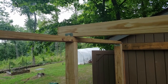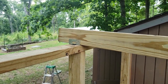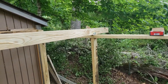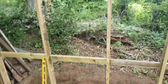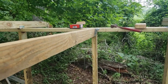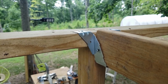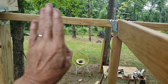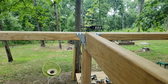So this was our first plan — we just put one up. We had these up like this with a little 3.5-inch overhang and were going to put tin on that, with about a 12-inch overhang in the back. But we decided to change it — we're just going to leave the top open and put a tarp over it. What we did is we went to the inside with those little joist hangers, and the hardware cloth will just go right over the top. We'll run bracing and purlins all the way down on each side. I'm going to get all these hangers in, cut the boards, and go from there.